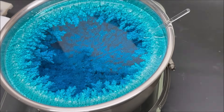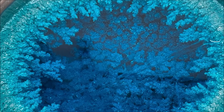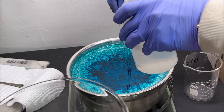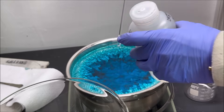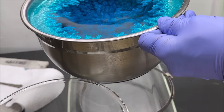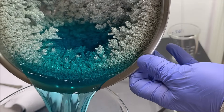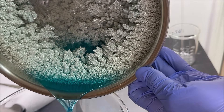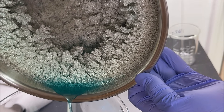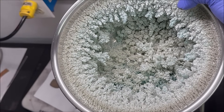And reveal the pure silver crystal down in our silver cell — look at that! Now let's pour off the electrolyte. As I stated earlier, we're going to be reusing this electrolyte a second time, so I'm going to pour it into this five liter beaker and save it for the second run of the silver cell. And there's our beautiful pure silver crystal — about 1.5 kilos.